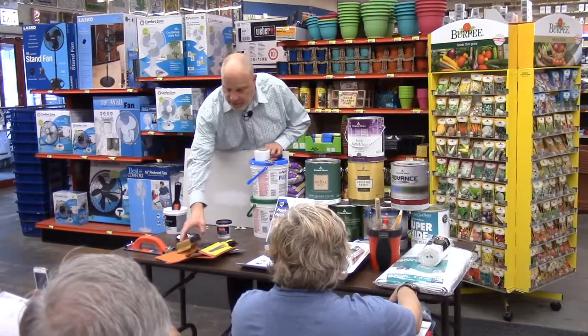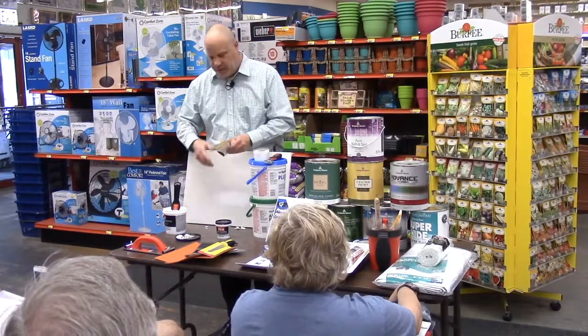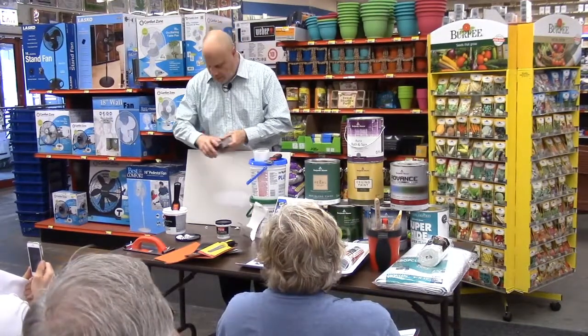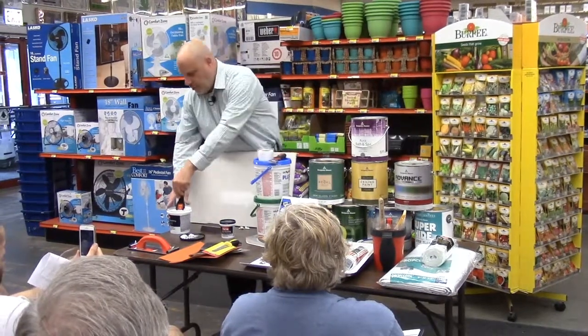After these are dry, come back with your sanding block and give them a nice light sanding. These are almost dry, which is kind of why I like using the lightweight stuff, especially on smaller nail holes. We give it a simple, real light sanding, and then put one more finish coat on.